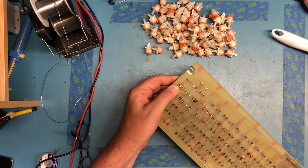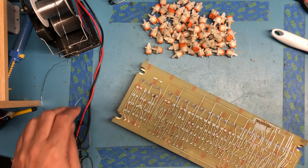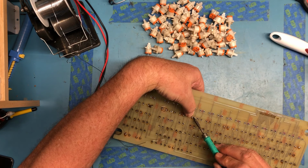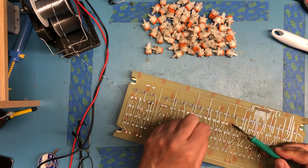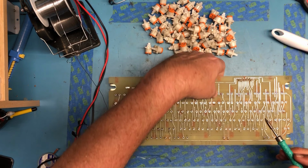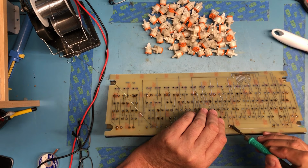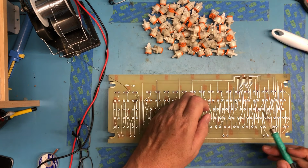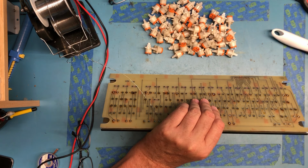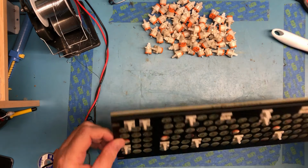I didn't think that one was down flush, and it wasn't. Let's look flush. I'll hit one here in the middle. Felt that switch move up flush. It's not really critical, I guess, that these be perfectly flush. The mechanical strength of the keyboard is in the metal frame here, and the switch is snapping into it. The PC board just really floats on the back.